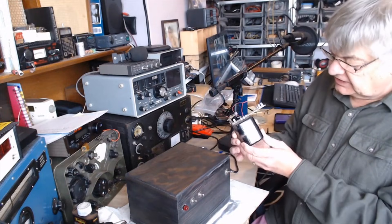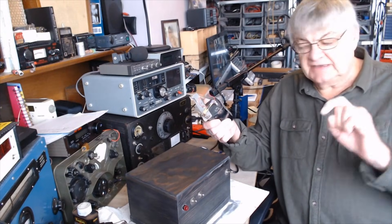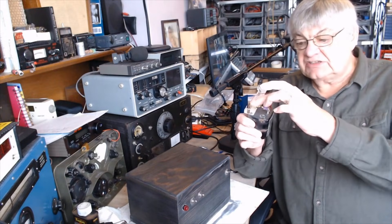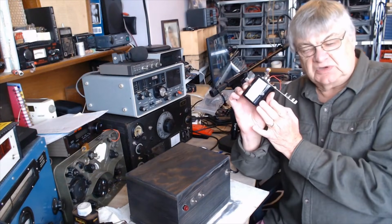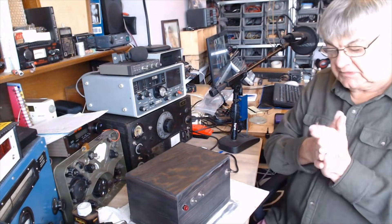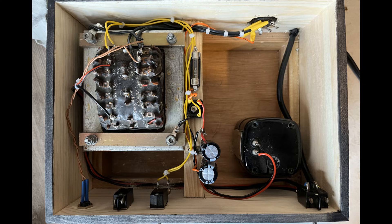Martin — I know you watch these videos. I've put one choke in here and this is a spare one, which is rather nice. In a valve radio you've got two smoothing capacitors normally — one aluminium can either side — and between the two is a resistor. That's a smoothing resistor. You've got the reservoir capacitor one side and the smoothing capacitor the other side. You're far better off using a choke. This is an LF choke — a low-frequency choke — and what it does is choke off any low-frequency hum. The resistor does a good job in most cases in vintage valve radios, but in decent equipment like this you're better off with a choke than a resistor.